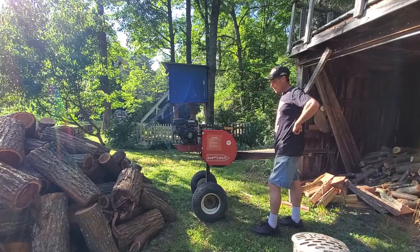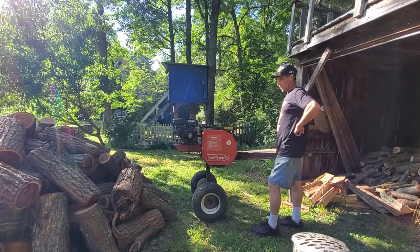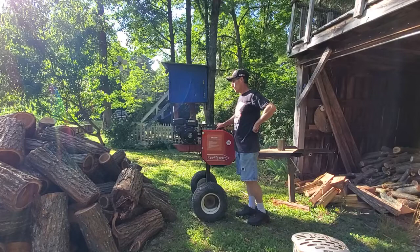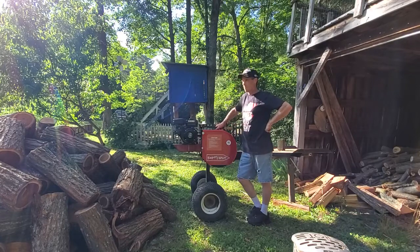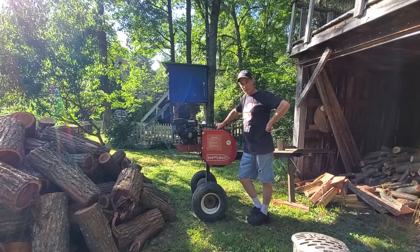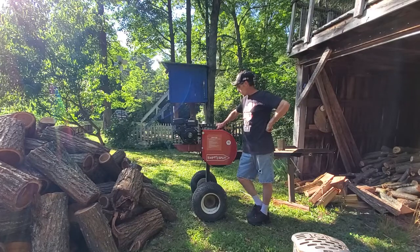With a 10, I don't know. I mean, that would run our well pump, but it certainly wouldn't run our tankless water heater. Certainly wouldn't be close to every big 220 item I have. It would pretty much put that generator head at 60-70% max. So I gotta think that through.